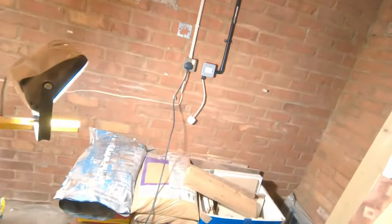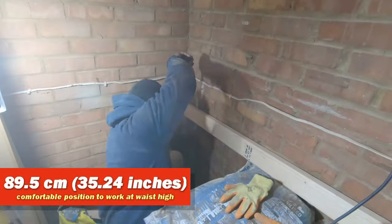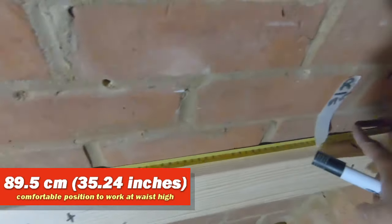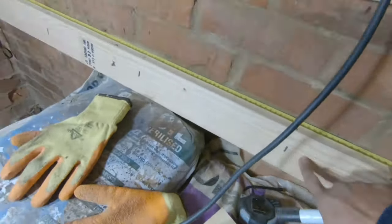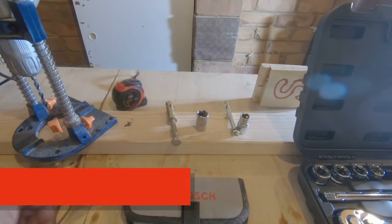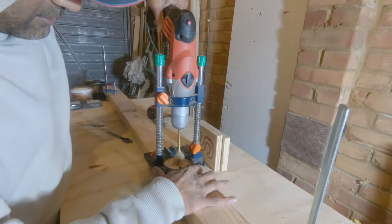The L-shaped bench is going to go at this side of the garage, and I'm using a height of 89.5 centimeters — that's the height of my Triton work center. Here you can see I've placed a 2x4 and marked positions where I'm going to anchor-bolt it onto the wall. I'm using a spade bit to create a recess so the bolt heads stay flush. This 2x4 is the main structure on the wall.